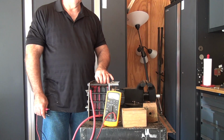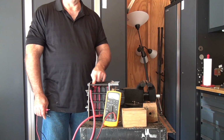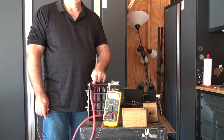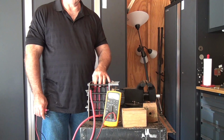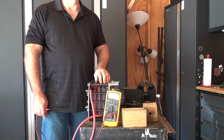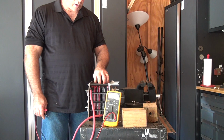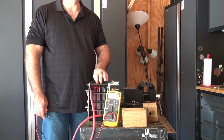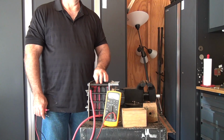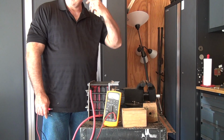So I'm thinking about taping the edge of the plates like the old ones I have. The first 30, I taped all the edge of the plates so the edges couldn't touch. And I'm going to go back, take it apart, and tape all the new plates the same way. But also I'm going to put a little spot of 1 by 1 inch spot of gasket material in the center of each plate so that the centers won't touch.